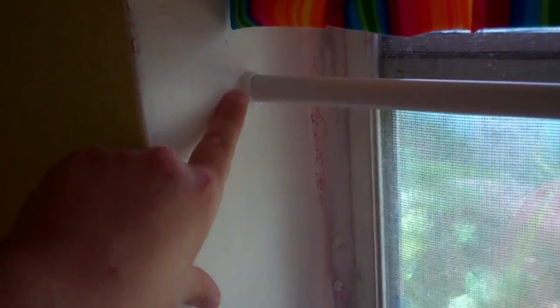All right, you couldn't totally see what I was doing. When I was talking about how you had to position the one end where you wanted it, this is what I was talking about. I wanted it to be in the middle of the wall here. You position the one end that's going in first, while the other part is sticking out to the side here. Remember, you want it to go a little bit outside the wall because you're going to be pressing it in, and that's how the tension keeps this thing up when it doesn't have any hardware. If you try to get it perfectly within the wall, it's not going to stay. You have to have a little bit coming out. But first you position the one side.